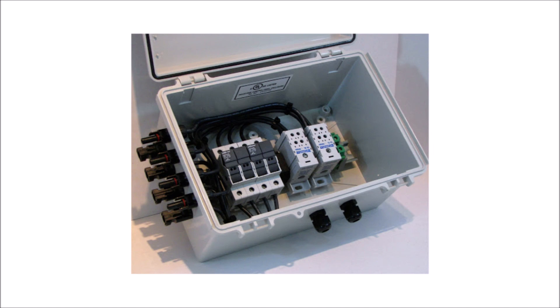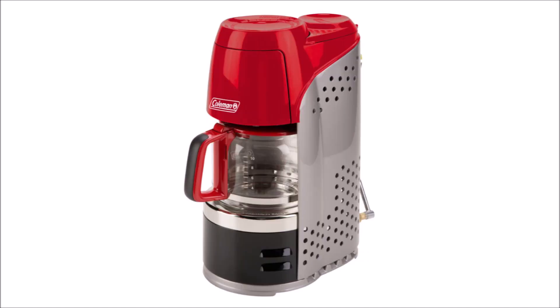Multiple strings of solar panels can be connected to a simple combiner box before feeding into your solar charge controller, and the MC4 connectors that you see on the left side can be easily disconnected so that the ground mount can be stowed away. Another strategy is to focus more on decreasing your electrical consumption so that you can get by with just the panels you can fit on your roof. For example, instead of packing that electricity-guzzling coffee maker, invest in a propane unit instead. Remember, it's easier and cheaper to decrease demand than it is to increase supply when it comes to solar.